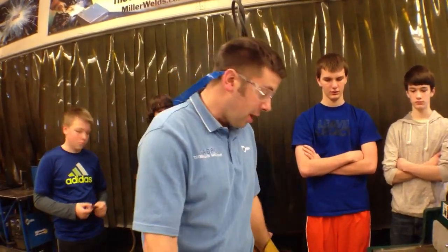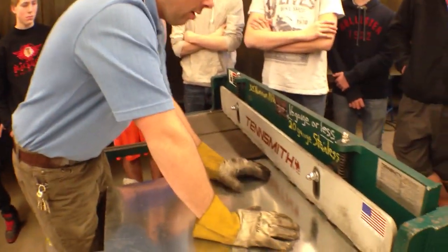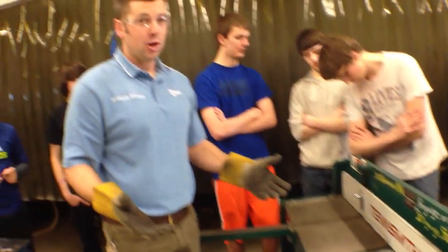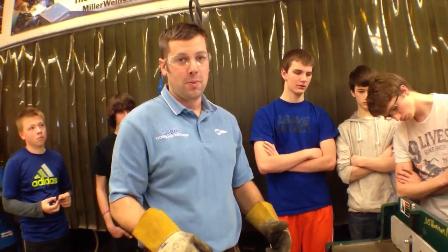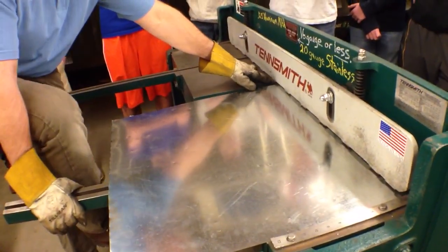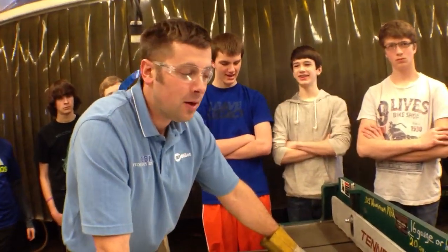Main things to remember on the shear as far as safety goes. Number one: you're the only person that operates this. We've had one person get injured in the last couple of years — they were of small stature shearing heavy material, didn't have enough weight to operate it, so they had somebody else jump on it while they were feeding material in, and they got a fingertip caught under the guard. The guard didn't smush the fingertips — the blade would be much worse, like having a shorter finger. If you're operating yourself, it's never going to happen because if you feel your finger being smashed, you have the sense to stop pushing down on the lever. Operate it yourself.